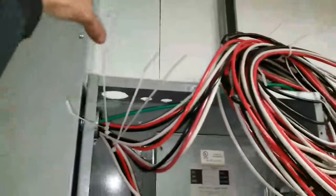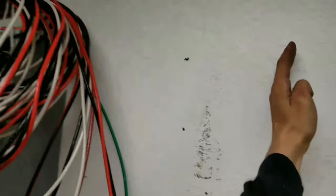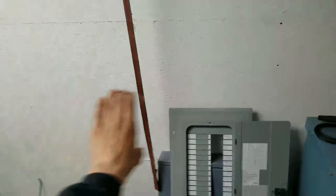So here's the gutter in with the panel board, and then I'm thinking I'm gonna bring another gutter right across the top of here. The other panel board's gonna stop about here, somewhere in there. You can see it over there, and then I'll gutter all the way across the bottom, and I'll have a gutter between the two tops. And I'm going to keep the gutter going all the way down. It's going to come up. Instead of that LB, it's going to be all gutter right there. And then I'll have the gutter down low.